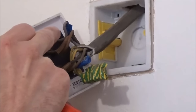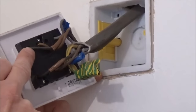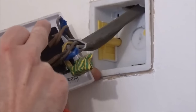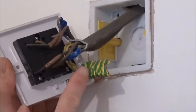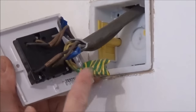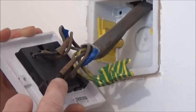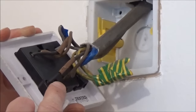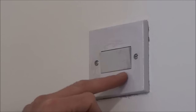The terminals are marked L1, L2, and L3 on both top and bottom — just match the colours with the corresponding number. The black cable on top goes into L1, and L1 on the bottom as well; brown into L2 and L2; and the grey neutral into L3 and L3. The earth cable doesn't go through the isolation switch — connect the two earth cables together in a small connector block wrapped in earth tape. This provides continuity along the earth cable all the way from the ceiling rose to the fan. Leave the switch in the on position so the fan is operated by the light switch outside the bathroom.